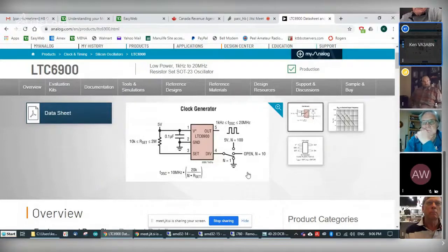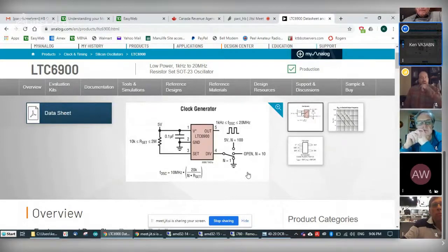With the DCR, other than that, it works like a charm. The DCR is so nice. The bands have been really bad, except for the CW. The CW is really good. I've heard a couple of voice contacts, and it works really well on sideband. The only thing you've got to get used to, because it's a direct conversion receiver, is that if you tune on either side of the carrier, you're going to hear both sidebands. And that's what's on my table.